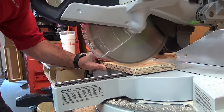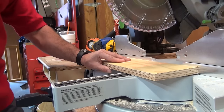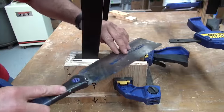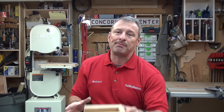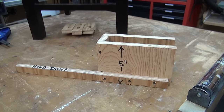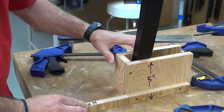I ripped a nice long piece on the table saw to five inches wide, then cut it into three pieces to make my cutting jig. The long portions of the jig are an arbitrary size — I left them long so I could rest the saw on top and use them as a guide. The back edge or spine of my jig is the exact thickness — just a pencil-width bigger than my leg. I also added a strip on my jig used as a hold-down clamp to keep it secure on the table. You can also screw it to the workbench.